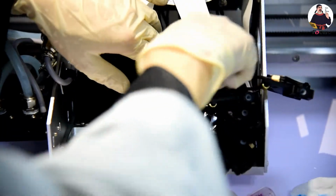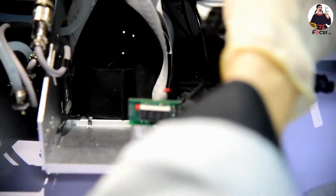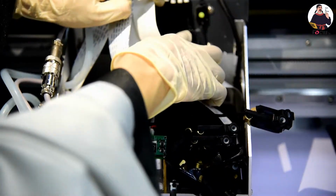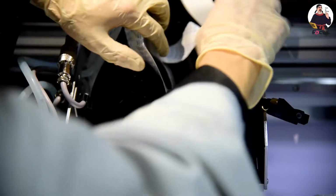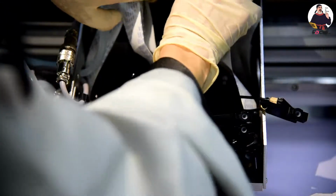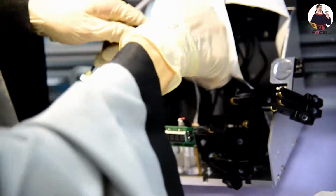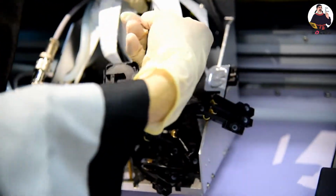Then we do the same inside the white. When you do the white print head, you must be careful. One tube transits to two tubes. One big tube to two small tubes. So when we connect the tubes, we must pay attention to that. First, we find the two dampers with one tube. For example, these two dampers were connected with the same one tube.